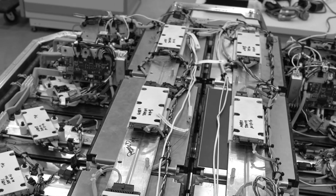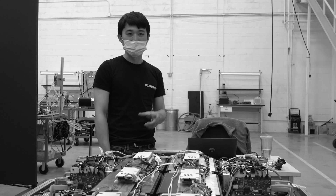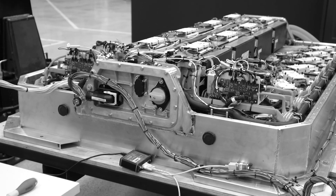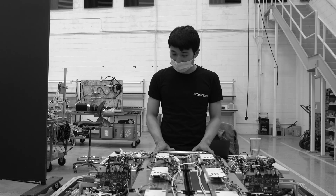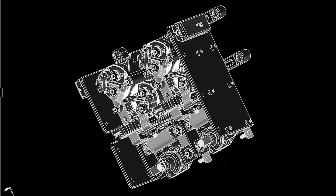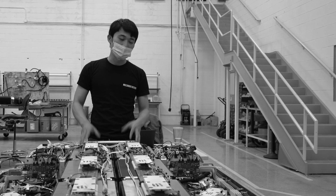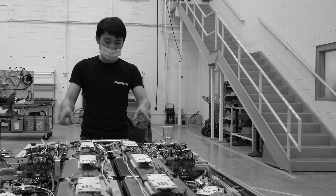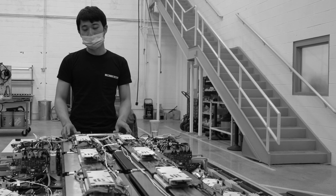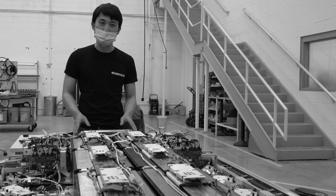What it's doing is there are little resistors balancing all of the voltage of all the cells in the modules they're connected to. Starting from the back — this is towards the rear of the vehicle. The most obvious things you see here are the two sub-assemblies, which we're calling the string power distribution units. Each of the battery strings, which is a little mini battery pack, connects to half of one of these PDUs. What that does is it turns the string on and off with contactors and connects it to the main battery bus.